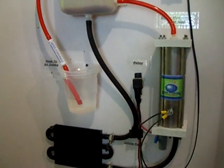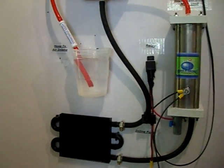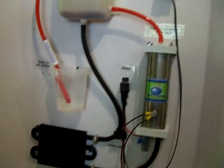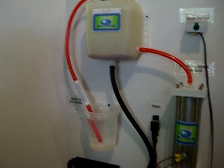In the winter time you can add methyl alcohol to your water mix, and that will let you be able to run it down to about 15 degrees Fahrenheit. Anything lower, we suggest just drain the unit and wait until warmer weather to reuse it again.